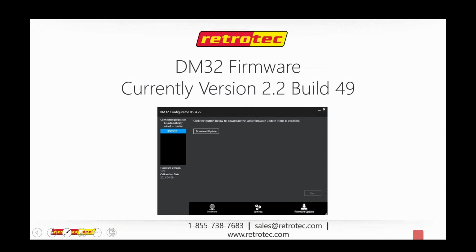As many of you know, or some of you don't know, the DM32, which is our newest gauge, only needs to be calibrated about every 5 years. The reason for that is it can update firmware right online. Right now, the most current version is 2.2, build 49. If your DM32 is not on the same version or build, just update it. Plug it into the gauge configurator, and it will check online to make sure it's up to date. That's the first thing you want to do: make sure you're using the most up-to-date software.